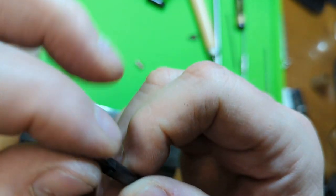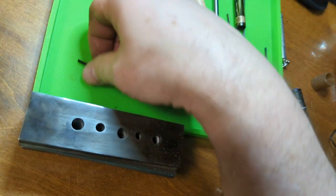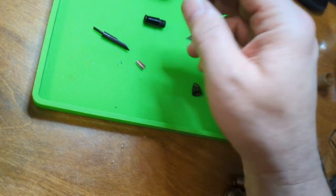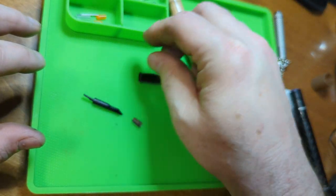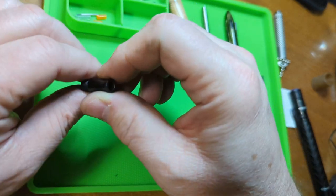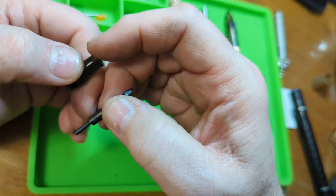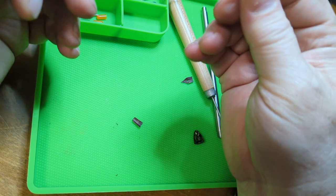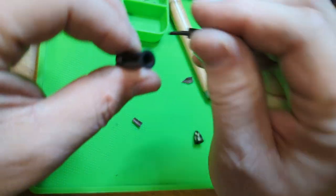It did put a little ding on the side of the feed. You can see where it was notched - almost like a screwdriver could fit into it - and it kind of fell down inside one of those notches and widened it just a hair. I don't think that's enough to cause any harm, and our centerpiece is intact. It's usually a bad idea to take apart a vintage pen to knock the feed out, because they perfectly fit and they've been together for 70 years or more. This pen is probably from the 1930s - we're talking about a 90-year-old pen, and it's been in there for 90 years.